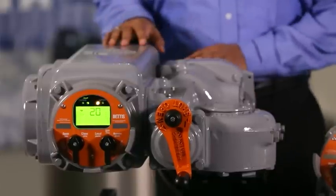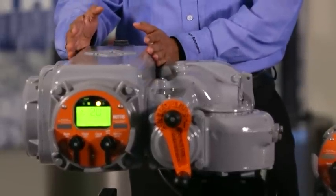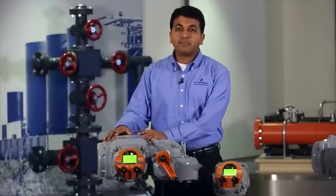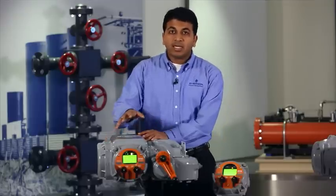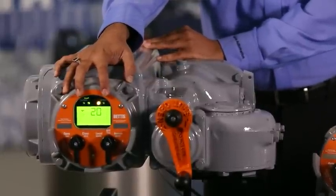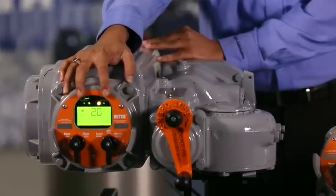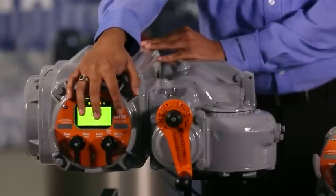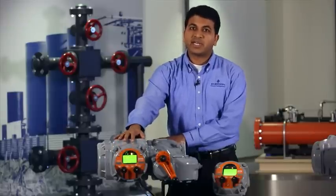The design of this actuator has three major components. The first one is the electrical controls compartment, which is made of marine-grade aluminum alloy with polyester powder coating and passes up to 1500 hours of ASTM salt spray testing. This local display module has a larger backlit screen with better contrast and has alphanumeric text for ease of use and also comes with multi-language capability. The knobs are non-penetrating, vibration-resistant and with hall effect sensors to maintain the non-intrusive rating of our actuators.